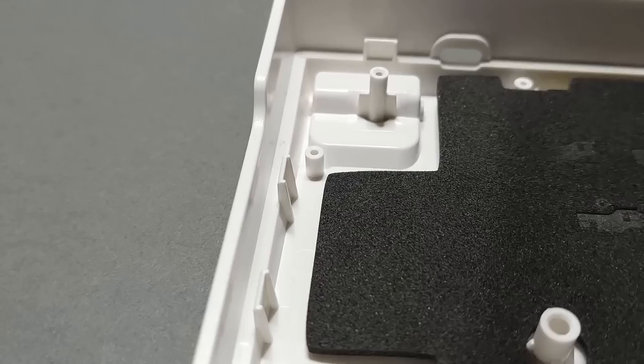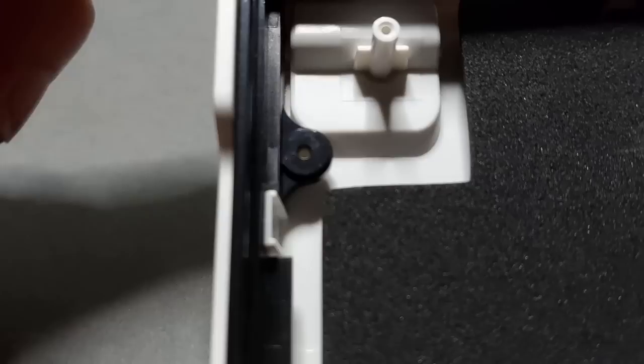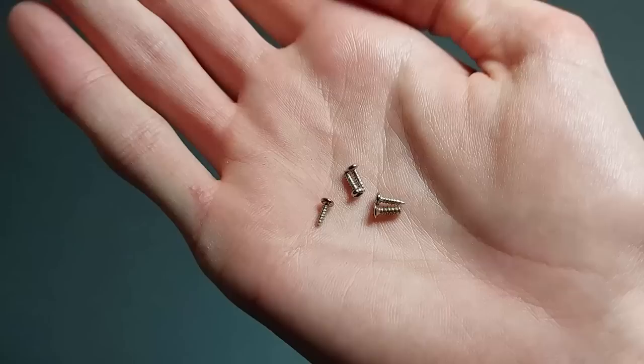After looking more closely at the black plastic frame which was trapping the PCB and top plate, it appears that it is supposed to be screwed to the base. There doesn't seem to be screw threads, so it clearly wasn't secured from the factory. I took some tiny little screws and fixed the top black frame to the base, which fixed the issue.